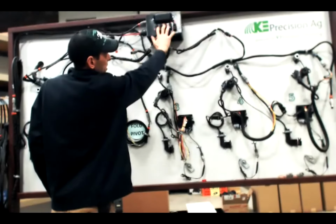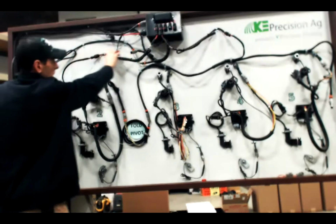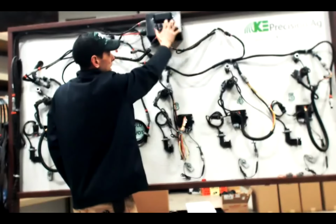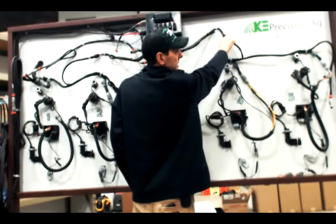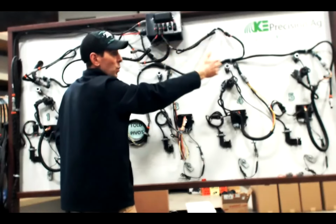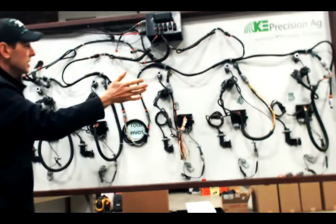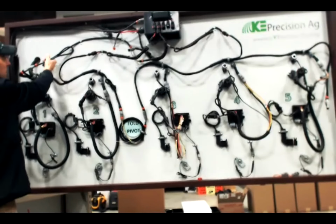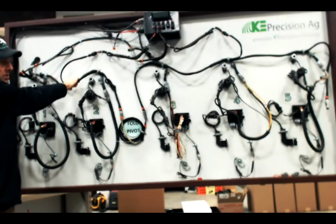Power are these wires that come off of the bank on the front. So power is fed into the middle of each backbone, and you just get the necessary length extension to make it from the PDM to the middle of that backbone where you have a power tie-in. So if you have a power issue with no lights, maybe on a wing or something, it's going to be in this harness. If you have a CAN or communication issue, a daisy chain issue, it will be in the CAN path, which is this extension to the PDM or the backbone itself.